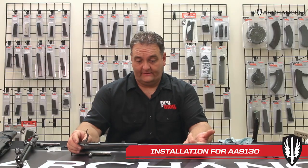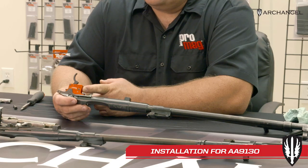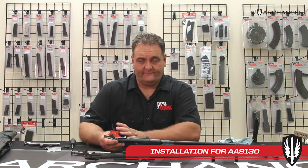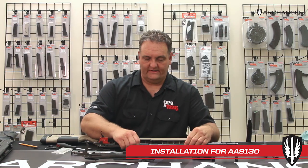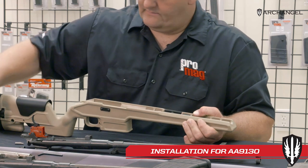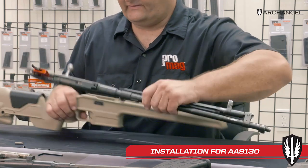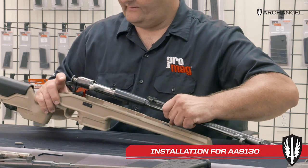I'm going to set this rifle aside because it needs to be cleaned before we install it in a stock — I'll grab this one here, which has already been cleaned up. That brings me to mention the Timney trigger — a great addition to the Mosin rifle. It makes it go from a long, creepy, rough trigger to a modern, crisp, nice breaking trigger. With the banded rear sight, you'll need to remove this little plug using a Phillips screwdriver, simply remove the Phillips screw in the center, and the plug will come right out. With your Timney trigger in place, you don't need to put the plug in the back, so leave that plug out.